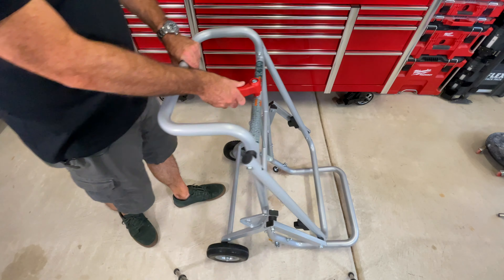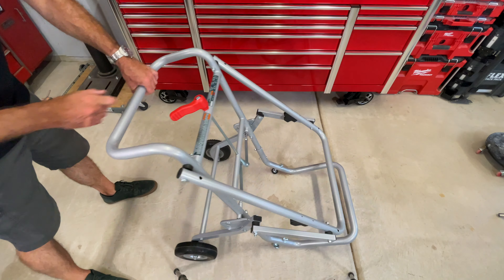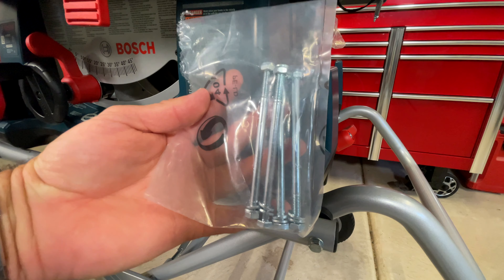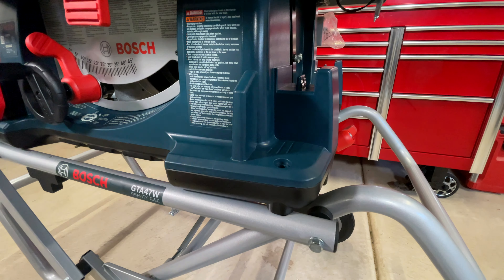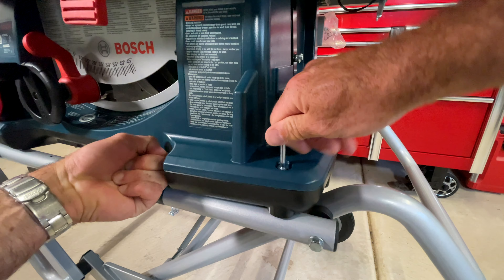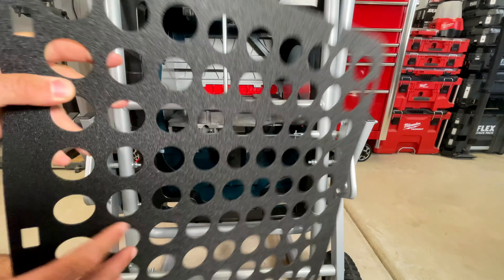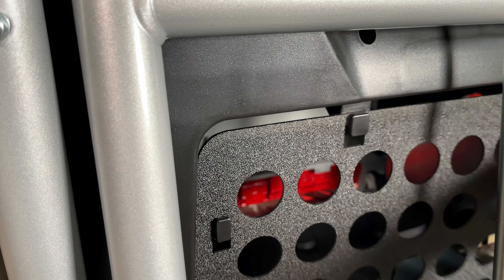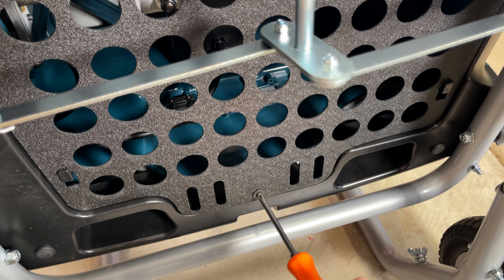So simple enough. Turn the lever, push down, it latches. To undo the latches, just raise it back up. So we've got four bolts in their own bag — long skinny ones. Hole here, hole right there, we'll just line them all up. Washer on top, washer on the bottom. Last order of business: we pulled the styrofoam out and we're going to install this flexible screen on the bottom. There's one Phillips head screw and a bunch of holes that we're going to slot in. You're going to have to work it around a little bit to get them all lined up. Once you have it all slotted in, tighten the screw. There you go.